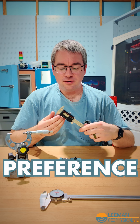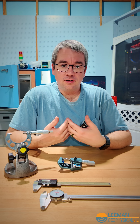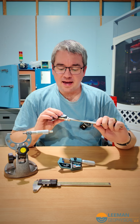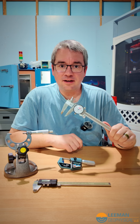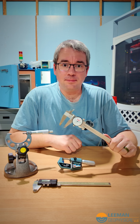Really, it's a matter of preference. You can use whichever you like. They both do a good job. I prefer the analog instruments a little bit more because it makes it easier for me to do the math — I can measure something and easily just count how many ticks of material I need to take off to get to my target diameter. I don't have to do that math in my head, whereas with the digital caliper, I do.